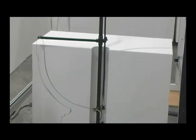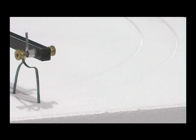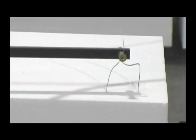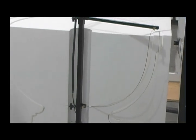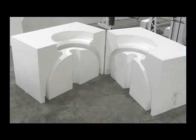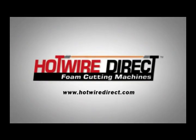The bowl cutting attachment sits on the rotational axis motor and uses rigid wires bent to a profile shape. The computer controls the rotational motion for perfectly smooth cuts every time. This planter mold is cut in halves and when put together forms a custom precast concrete mold. Foam molds can usually be poured several times and are commonly hard coated for repeat pours. The foam positive can also be hard coated and used for a foam planter.